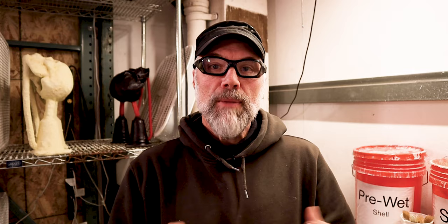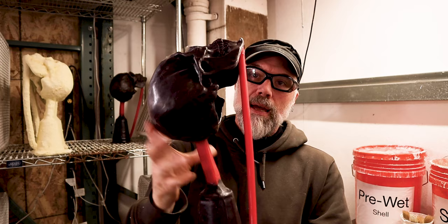For what we're going to do in dipping these skulls, we've just sprued it up simply — a simple cup, gate, vent, and the pattern itself. This object is pretty straightforward because it's spherical in nature, the skull itself. There are very few hard edges.